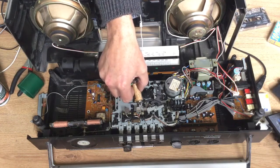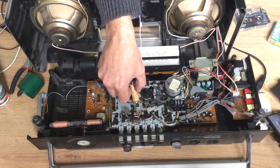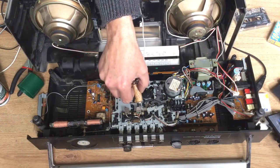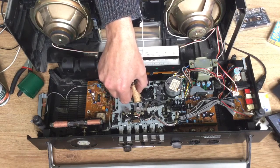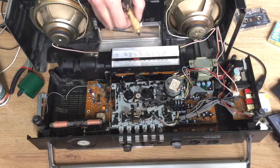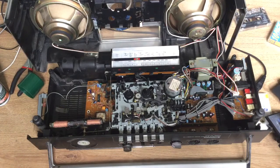I've used it on another tape head which was giving quite muddy playback, and you can also put a screw up against the solenoid core and you can feel it vibrate at, I don't know, 50 or 60 hertz, the mains AC.